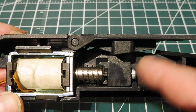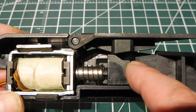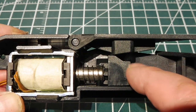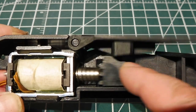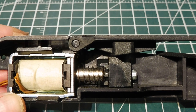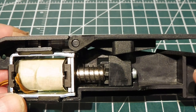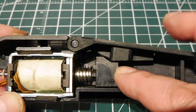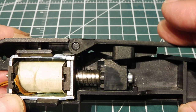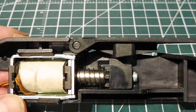Here's the mechanism that the solenoid activates. When the solenoid pulls in, this part goes from horizontal down to an angle, and when it releases it returns to horizontal. When I push this part down I come to a point where it locks — it stays locked until I press it again. This mechanism is part of an apple packing line, so we're going to visit the farm and see how it works in context.